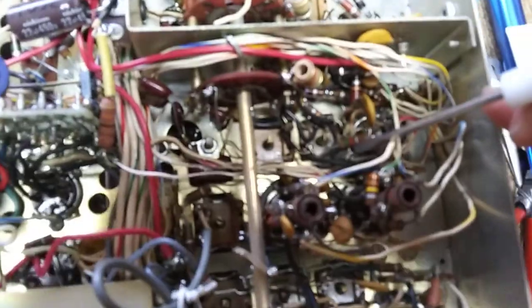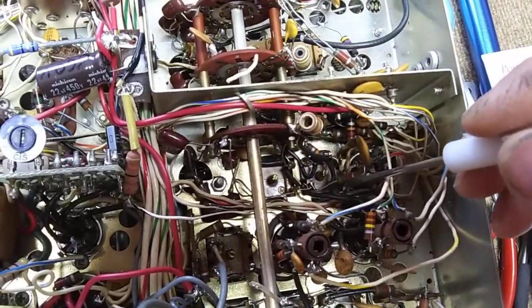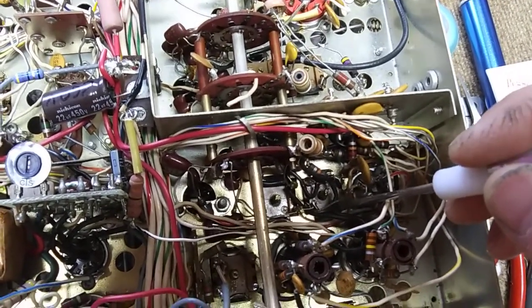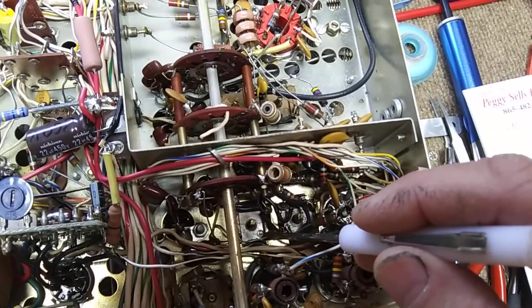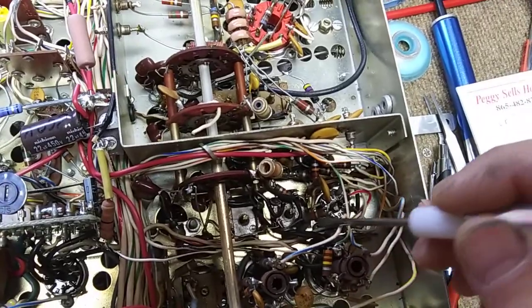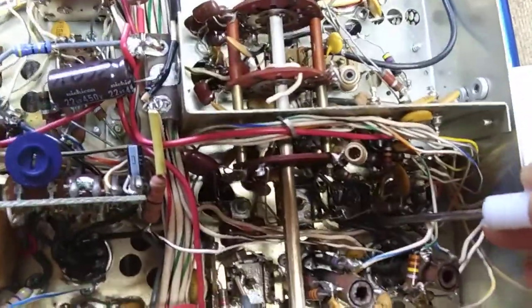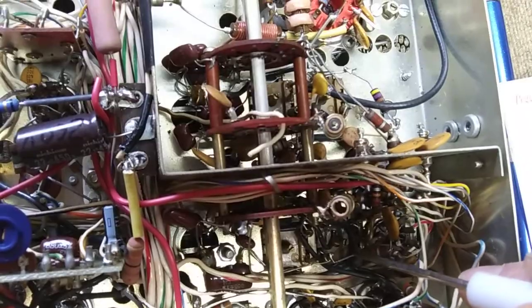In the radio, there's a very serious problem, especially in the TR3, of horrifyingly bad construction. This is a TR4 here that I'm working on. And in the TR3, my camera lost focus. This resistor, hopefully you can see that, that resistor lead shorted against a 250 volt supply because a lead wire pressed up against some cloth braid they'd put around the component leads, shorted and vaporized the lead connection from this transformer to that post. It's fairly easy to fix, but in this TR4 it's awfully hard to see, but there's a piece of wire here with black insulation around it, and it is pressing against that lead, and there's evidence of arcing on that resistor lead because the lead is burned black.